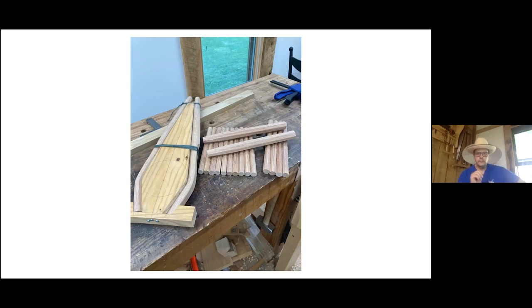These are most of the parts for a Jenny chair in a bending form — stretchers, all rough. Everything starts out square, then I use a story stick to get them to length and a marking gauge to get more consistent parts. The back posts and front posts I usually get to an inch and a quarter square. Once they're all square and to length, with the draw knife I'll make them octagonal, then begin to taper the foot. Those two longer posts have a taper on the foot and a taper towards the top.